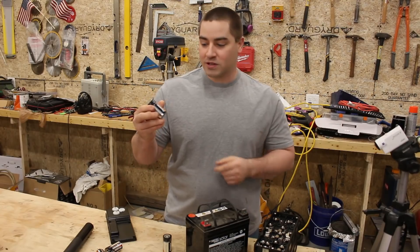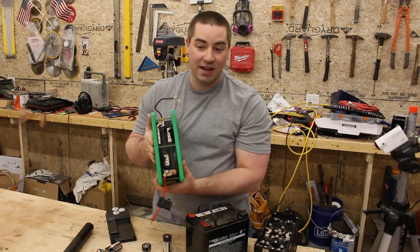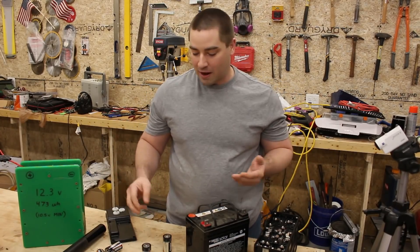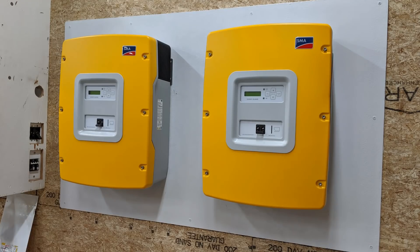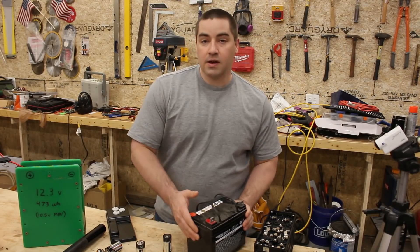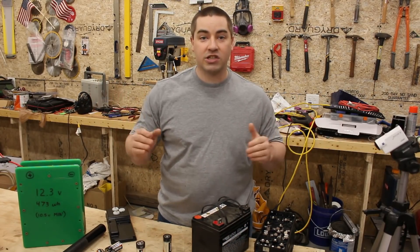The alkaline has a nominal voltage of 1.5V. This battery I built in a previous video out of some Chevy Volt cells — these have nominal voltages of 3.7V per cell. So it's fun to see what your chemistry is and what you want the end voltage to be to determine how many cells in series. What makes it even more interesting is that we have a range to work with. The inverters have ranges. My particular inverters have a range of 41V to 63V. That will vary depending on the type of inverter you have. Depending on the state of charge of the battery — whether the battery is full or empty — the voltage will vary, so inverters have to have a range they can work inside of.